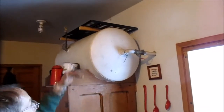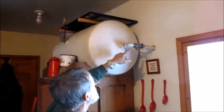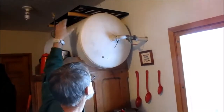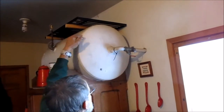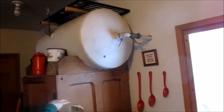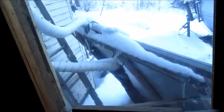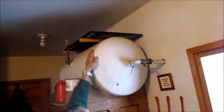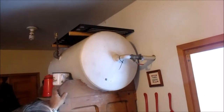The hot water tank is filled almost to the top with antifreeze. I learned by experience that you should have the inlet pipe halfway up so the water mixes in with the rest — if you put the inlet pipe all the way on top, it just stratifies and stays hot at the top. So I put it halfway down. In the bottom inside this oak cabinet is a second pipe that runs to the bottom of the solar panels and naturally siphons. On a hot day it'll get hot enough to almost burn your hand.